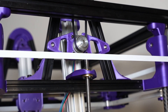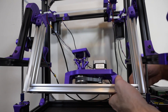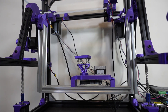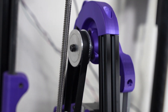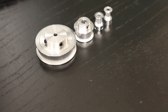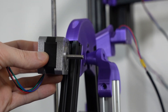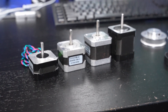I suspect there isn't just one cause. I have three main suspects: first, the belt may be too elastic for this amount of weight; second, the entire U-axis may be too heavy for this small motor, resulting in too much inertia that the motor struggles to hold; third, the combination of plastic and aluminum has some play and is somewhat elastic. Here are a few solutions I have in mind. Option 1: change the gear ratio — by changing the ratio I could potentially add torque at the cost of reducing final speed. Option 2: ditch pulleys and belts altogether and opt for a direct drive, which would simplify assembly and reduce the number of parts — however, this will involve some math to calculate the right motor size, so I'll leave it for later.